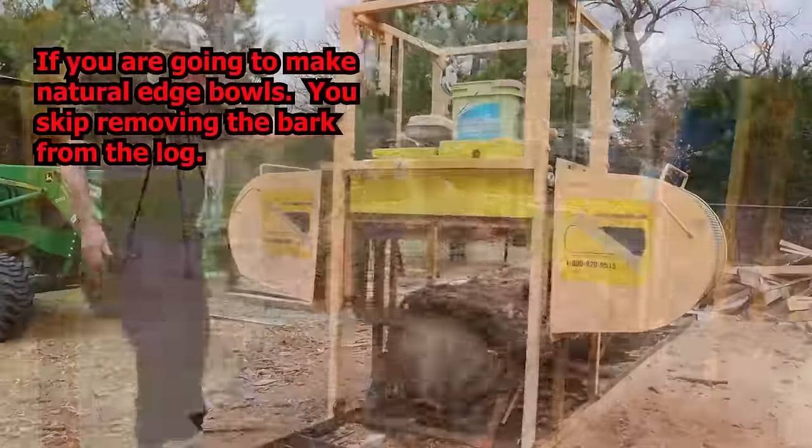To do that, there may be five or six of these type bowls, one on top of the other, but there's gonna be a spacer between them, and they're sitting on some wire. If you had a plywood shelf, I'd put these under the bottom blank. These are handy, we use a lot of them. If I just take them in there and stack them like that, when you break these apart, there's gonna be black mildew in there because there's still moisture in this bow blank, and it is gonna ruin our bow blanks unless we allow a drying space with spacers. So let's get to it.